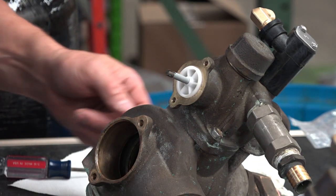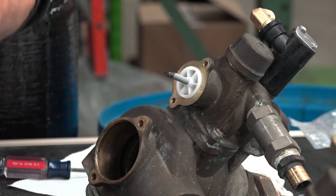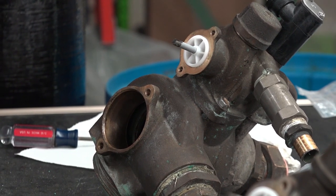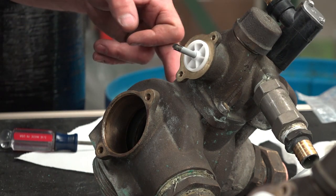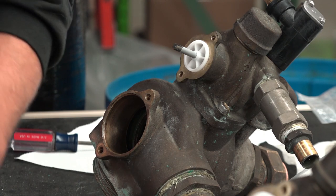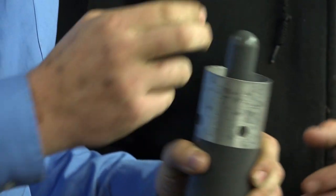That be. Now we can do the lower. Lower stuffer. Same way. Same exact setup. Well, this one's seal first or plastic first? That's seal first. So what you want to do, get these in, just put it on one side, get it started on one end, just push it in. Alright, so you made that look too easy. I've done it a few times. So put it in like that, yeah. Just feed it along to one end, and then just push that down, okay. You know, kind of pinch it together.